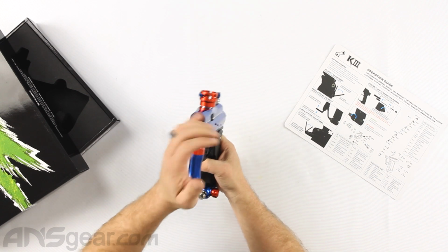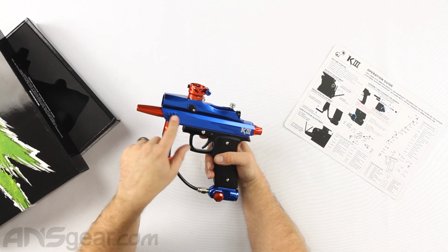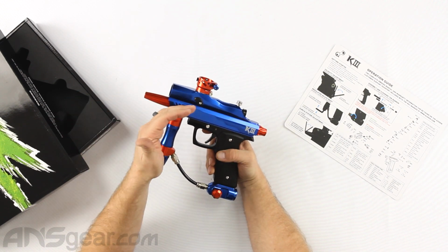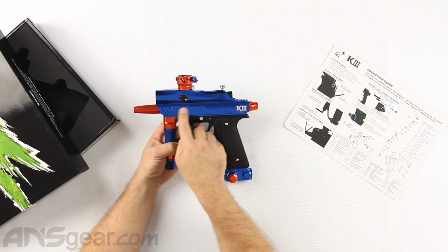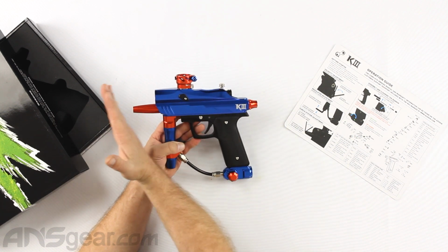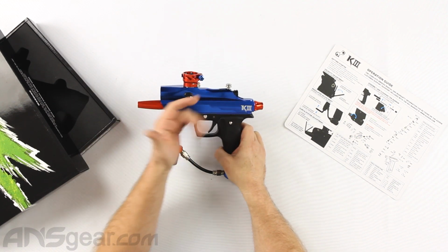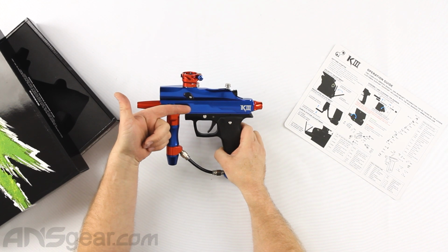And then they also have this, which is their 0D system. So this is a valve timing control system that's inside of here. If you're comfortable or knowledgeable about the valve itself, you know the valve is sitting in here and it has a pin that sticks through the valve. When the hammer hits the valve, it opens up and allows air to flow through. What shuts the valve is a spring that's inside of here. So the spring closes down the valve assembly.